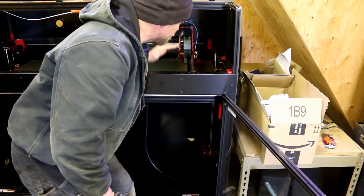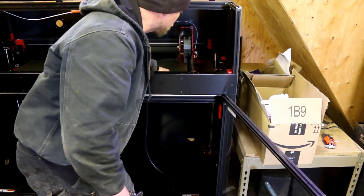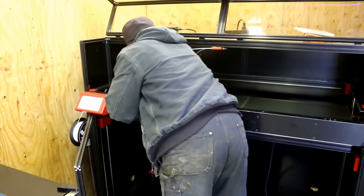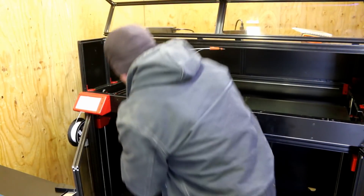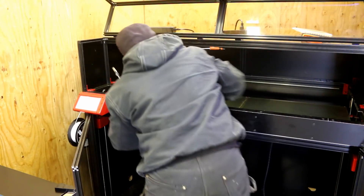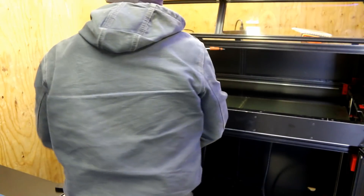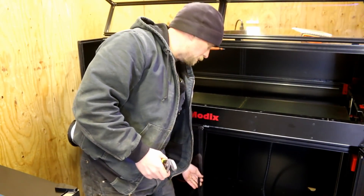It was a little carrywampus. I found that it was definitely not level — my bubble level confirmed it wasn't level front to back, so that's definitely a problem. I'm going to start this calibration process over. These back ones are a little hard to get to — kind of like brushing your teeth. This doesn't want to go underneath that one. You may proceed to the next step, which is automatic bed compensation calibration.